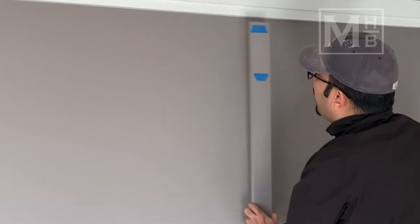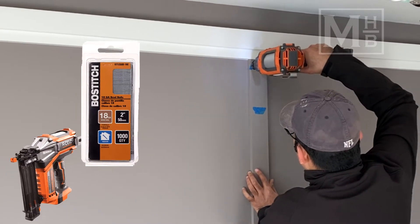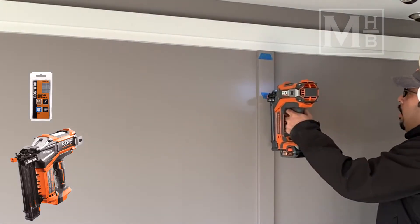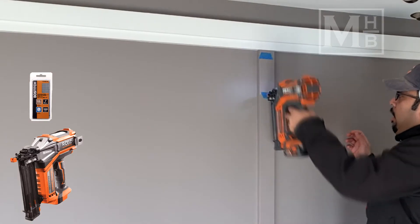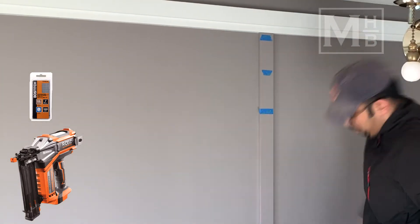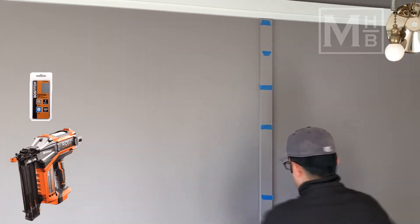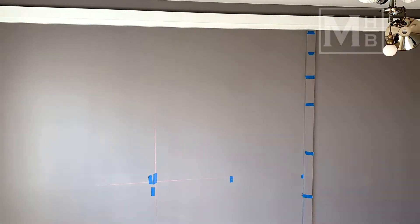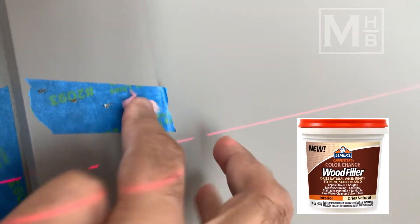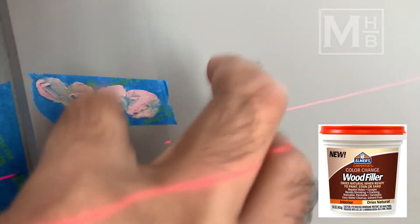To attach the trim pieces to the wall I used a Bosch GLL2 self-leveling cross-line laser to help line up the pieces and attach to the studs whenever possible. I started off by attaching the two vertical pieces using my Ridgid 18-volt brad nailer and 2-inch brad nails. A tip for this process is to also use some glue when attaching the trim — I did not do this, but doing so would help with better adhesion especially on warped walls. Another tip I picked up was to put blue tape over where I am attaching the brad nails, as this leaves a small hole in the tape which makes filling with wood filler later much easier, containing the filler only to the hole.